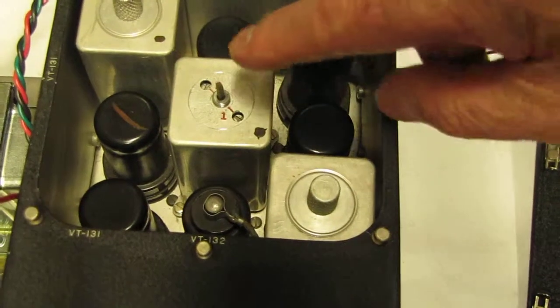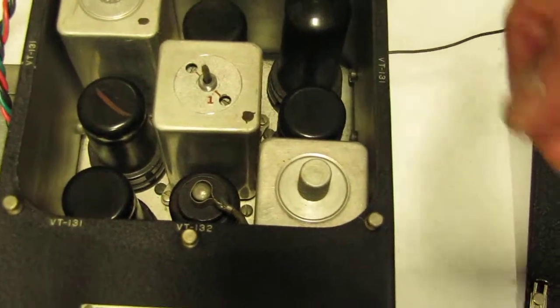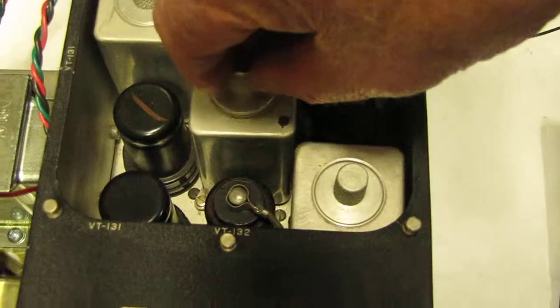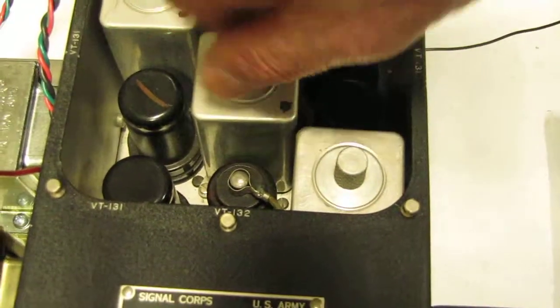Covers the next higher frequency band, and by pulling up on that rod you separate the 2 coils in the IF cans and can greatly increase the selectivity of the receiver, or if you want higher fidelity you push all 3 rods down. In this particular receiver all 3 rods are now up.